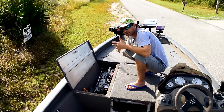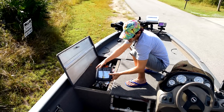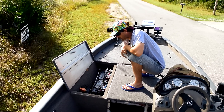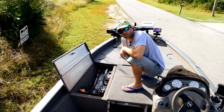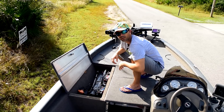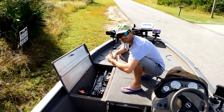I also run a couple of my graphs off one of these batteries — really easy, quick, short wiring, and I'm not having to run everything back to the cranking battery. I don't have an onboard charger. I use 6-amp car chargers from Walmart for about 40 bucks. I've had the boat about four and a half to five years and gone through two of them — they hold up, stored outside with a cover. It's also convenient because I can pop them off and charge that rear cranking battery too. The rod locker is eaten up by the 24-volt trolling motor setup, but I can still fit some lights in there.